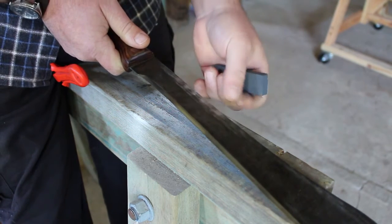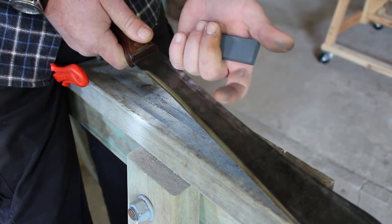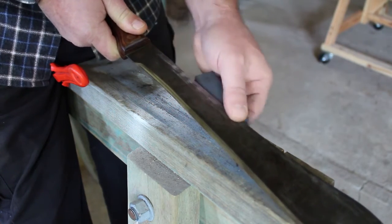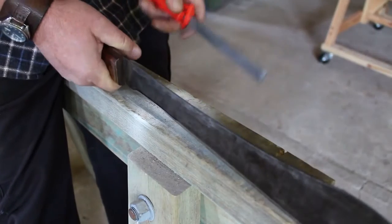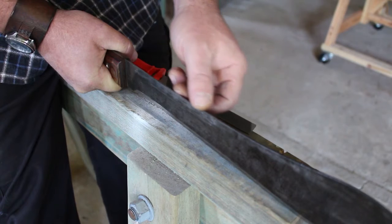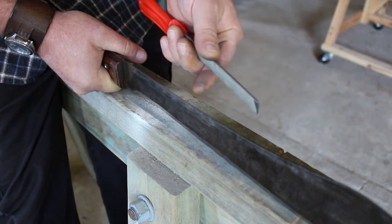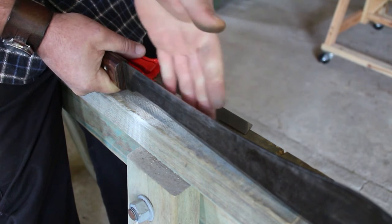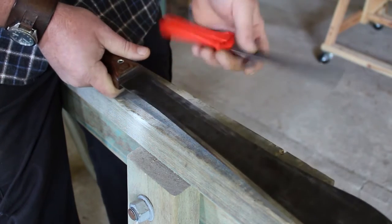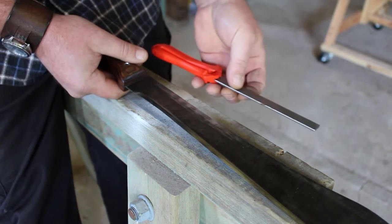You need to be a little bit careful here because a wire edge is actually a very sharp edge — you don't want to run your thumb or finger on it. Now that we've polished both faces of the machete and the spine in the area where we want to establish the card scraper edge, the next step is to use the chainsaw file's safe edge — with no cutting teeth — to move a little bit of the steel up and then roll it over.